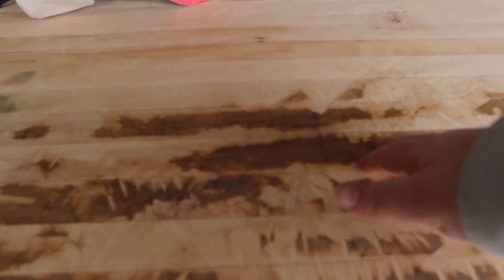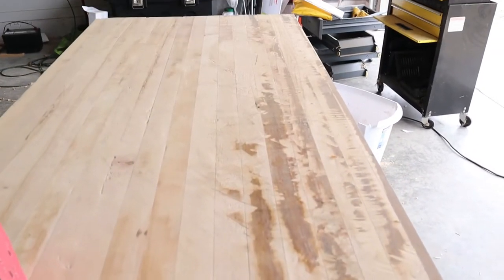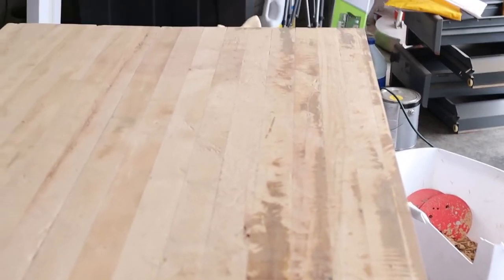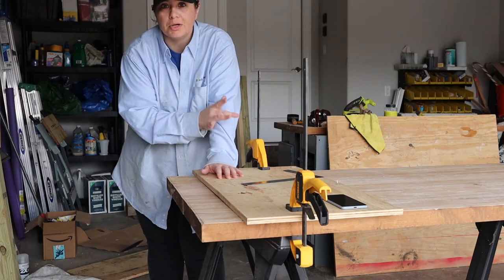I've gone ahead and started sanding. I'm going to try to get pretty close. My planing is not the best, but it did get most of it fairly even, which is what I was going for. I'm going back over it with 80 grit — you can see how much better it looks between the sanded and unsanded areas. I'm just getting the big parts off — extra glue — and then I'm going to go over it with 150 and 220 as well. It shouldn't take nearly as long, but because I'm not as efficient at the planer I'm going to have to right some errors with gouges. So we're taking out as many as we can and then we'll get it nice and smooth to the touch. Sorry about the lawnmower — but so is life.